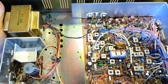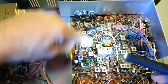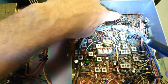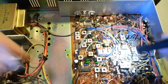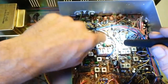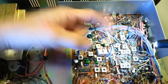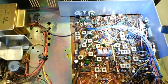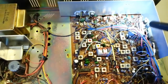I can pretty much tell nothing has ever been done because the VCO voltage has never been adjusted, and the last adjustment for the final transistor and the 54 MHz trap coil have never been adjusted since this left the factory. So I'm really not concerned about looking for modifications. Usually if somebody's been in here with their golden screwdriver, you'll see a lot of these little trimmer resistors turned to full rotation in one direction or the other.